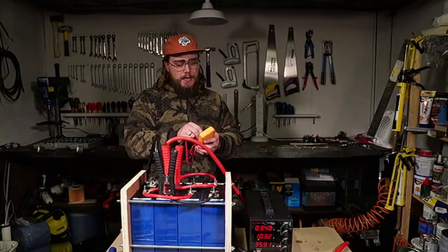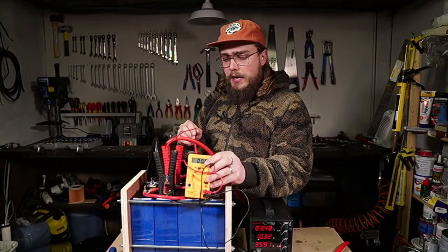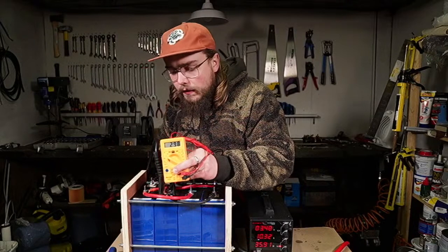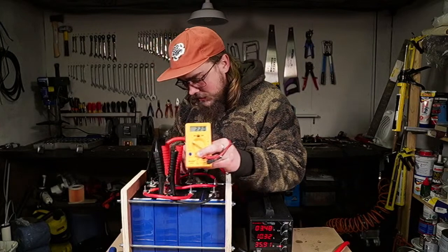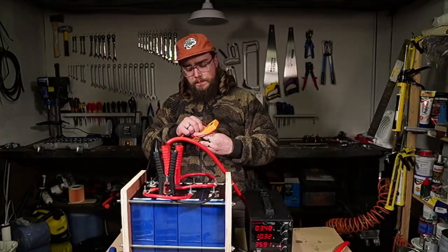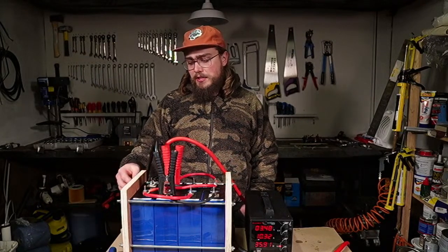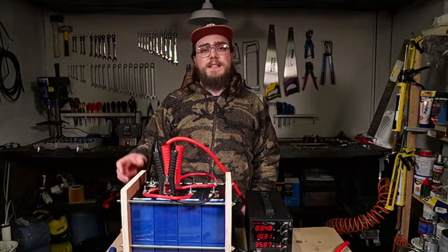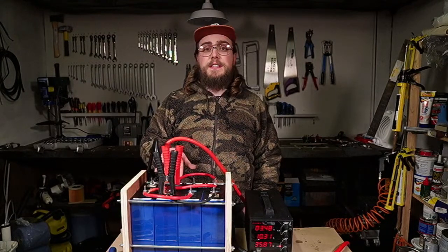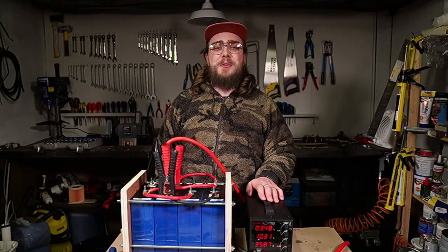If we check the voltage quickly — normally you'd expect to see the voltage on the cell you're charging slightly higher than the rest, because that's where the current is coming from the charger. That should read about 3.3 — and this one, 3.3. Cool, looking good. So we'll leave that for the next couple of days, and once we've got it charged we'll stick a BMS on here and do some capacity testing. I'm going to put out the video on Sunday onto our YouTube channel about how I fixed the stripped terminal. If you're interested, hit the subscribe button on YouTube. We'll do more of these lives — thanks for watching, and we'll see you guys next time.